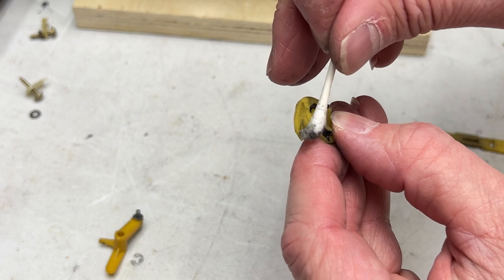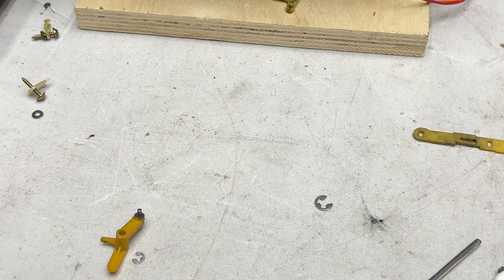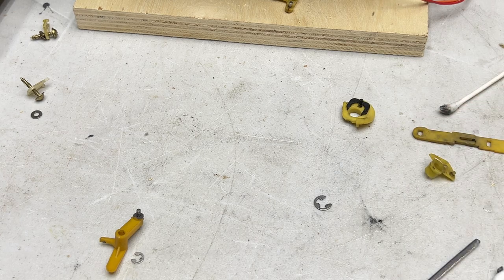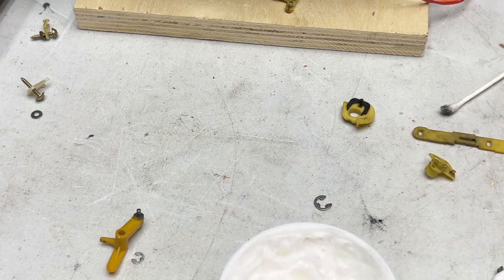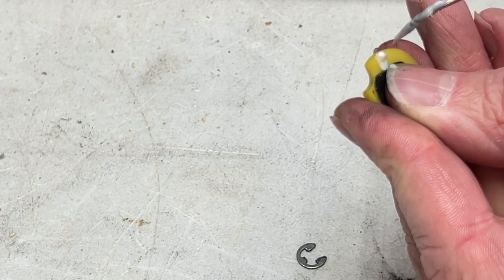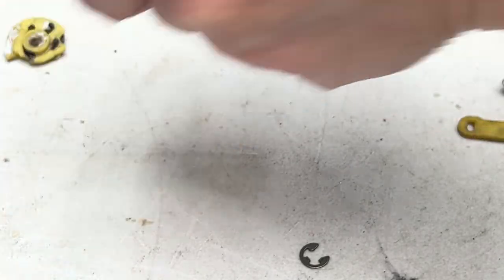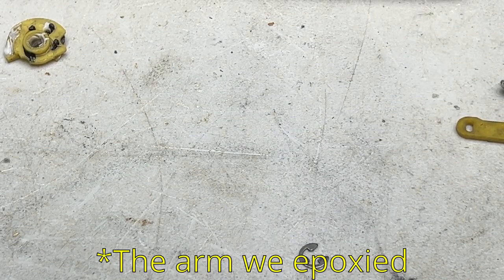This side's the one with the little slider for the idler up-down adjustment, so yeah, glad I'm showing that on camera, because I might have to refer back to it later. All right, I'm going to put that back together just so I don't forget where that goes. Grab my moly coat first, because I want to lube some of this stuff. And theoretically, that's ready to go back in, except we got to put that post back in first.